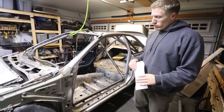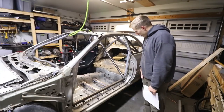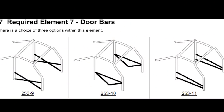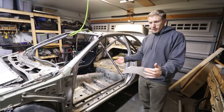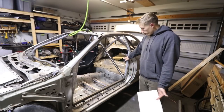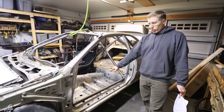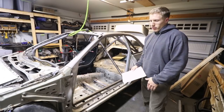Now you've got three different options to choose from — NASCAR bars are not one of them. The NASCAR style bars come out into the door and go back with vertical bars in between them. The options you do have include the typical X that you see in a lot of rally cars, and there are two ways to make that. One is all straight bars — one continuous bar with two smaller bars notched into it, then gusset the sides. Another way is a V or shallow U shape: two continuous bars with one bend near the center, meeting and welded together at the farthest radius of the bends for structural integrity, with gussets as well.